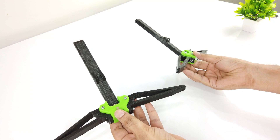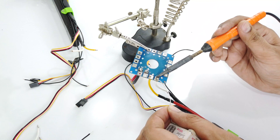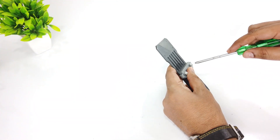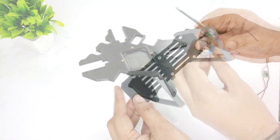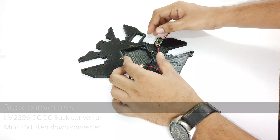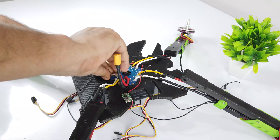I have attached both the landing gears and it's time to assemble the drone body. I'll start by attaching the M3 inserts of 6mm length to connect the flight controller. I'll be using a 100-ampere ESC power distribution board. This plate holds the battery in place. Now let's assemble the bottom part of the drone. I'll be using a buck converter to power the Raspberry Pi, and a smaller version of it to power the LEDs. Connect the battery mount using flip screws, then place the power distribution board in its mount and attach it using M2.5 screws.